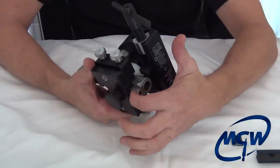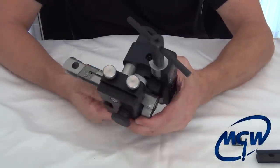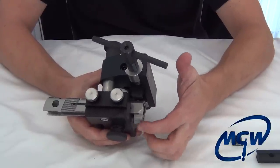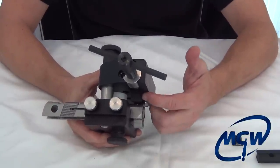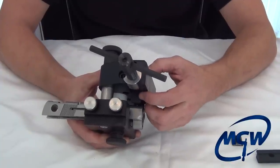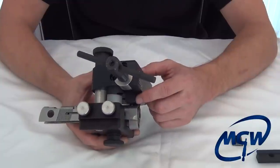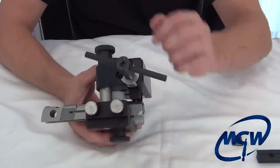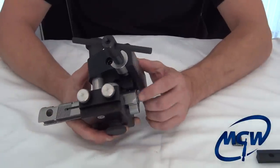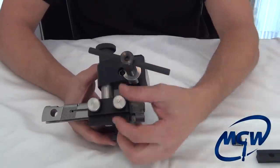This front sight — with this thickness of recoil guide — that sight is capturing it, but maybe not 100% ideal. So for this particular slide, I would probably go ahead and flip the whole bracket around and use the clearance side. But for now we'll show that it can push it just like that. Just make sure you bring your little slide clamps, and don't tighten these things tight — since it's on a screw they're not going to slip; just tighten them snug.